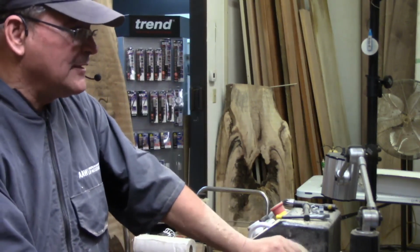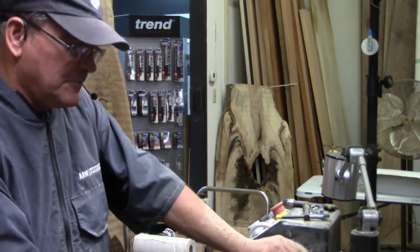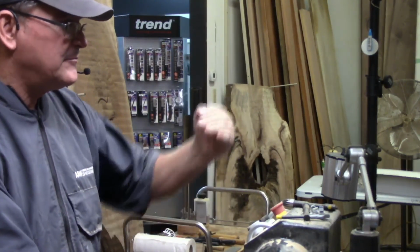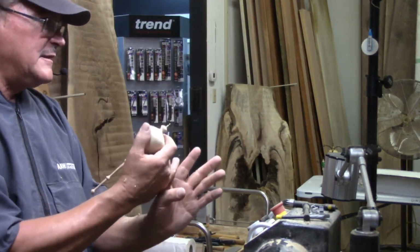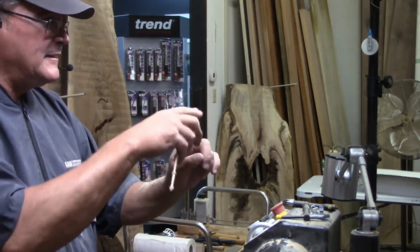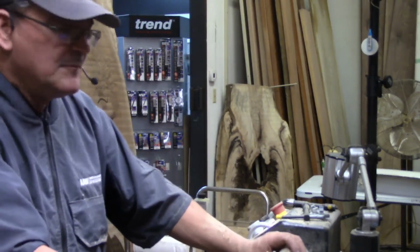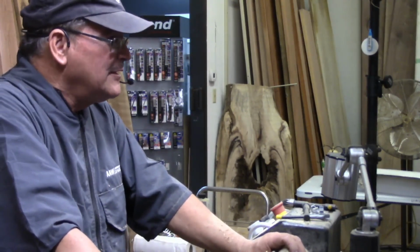Basically, you go to the grinder, take your little Allen wrench, and grind it kind of like what I ground these. Put a little round on the end there. Take off the bottom of the nose, grind that back a little bit, back and forth like that. Put a nice little curve or radius around the tip of that. You can turn a handle for it. I just use vice grips, because I know I'm going to lose a little Allen wrench.